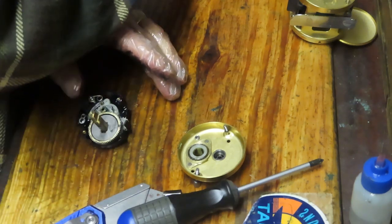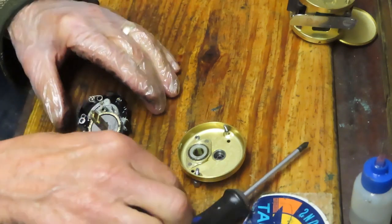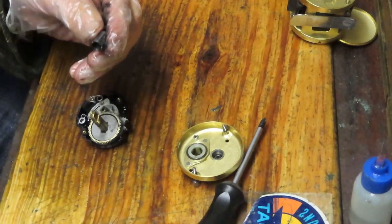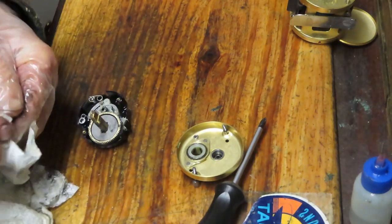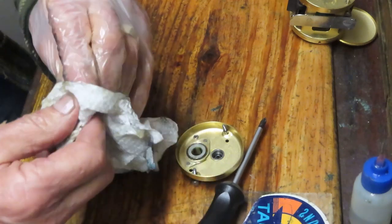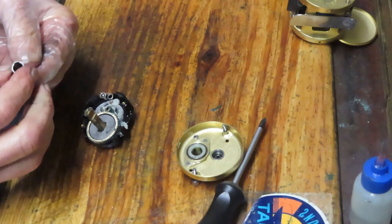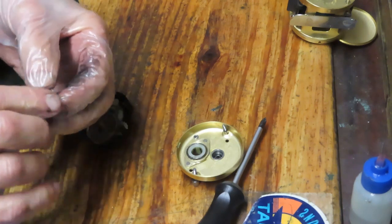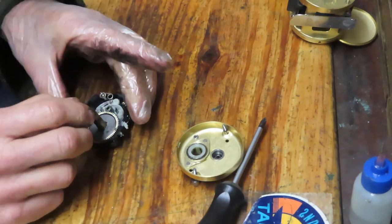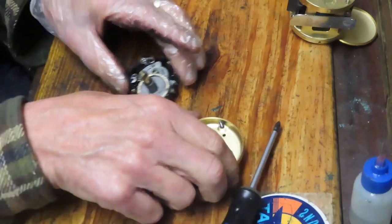And then you can go to your parts tray. Oh, that's your parts tray, it's sitting on the desk here. Get the collar for the anti-reverse clutch. Make sure it's nice and dry. Go ahead and install that. There's two studs on the bottom of this. Make sure that they go into the main gear and that seats flush with the main gear.